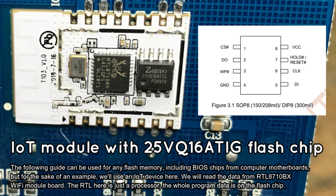Also keep in mind that some CH341 programmers might require a slight modification in order to use correct 3.3V voltage levels, but that's not the topic of this video. Here's the board that we are going to program. The chip in the SOIC case with 8 pins is a flash memory with program data. The chip in QFN is a microcontroller that runs the program from that memory. Programming could also be done using a UART bootloader, but we will use the SPI method as an example.